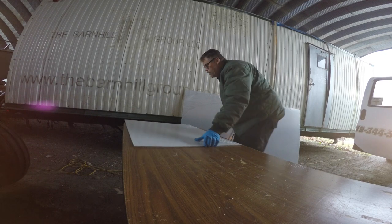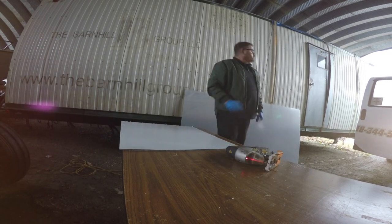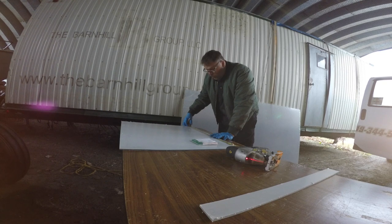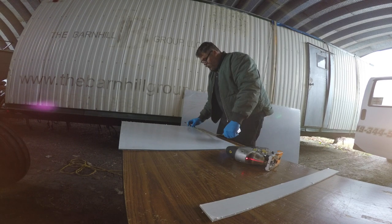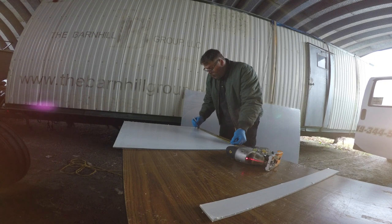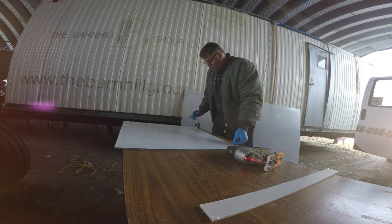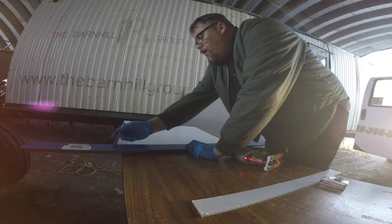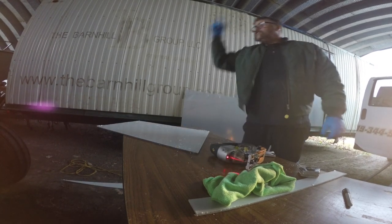Thank God for the red laser today. I have no fancy angle tools with me today. So our measurement is 19 and a quarter. Let's get the tape measure at 19 and a quarter. We're going to eyeball it for now. I'm not even close — let me redo that. Four and three quarters. If I had a calculator, I could do this really quick. Let's go four and three quarters — 19 and a quarter. Three and three quarters, four and a quarter. So let's go back to number four. We'll go 19 and a quarter, we'll get this, don't worry. So we got four and a half — right in the middle, that's it. We'll slice her down here. Now we're just going to go up and get the corners. We have a bottom corner and a top corner because of course they're both different. We'll cut her up.